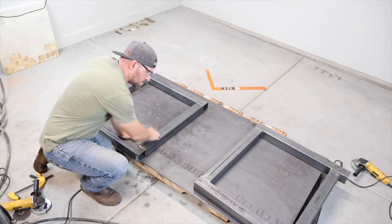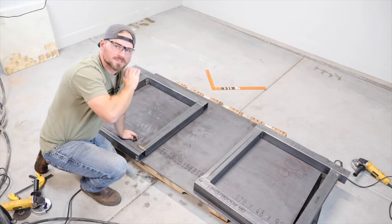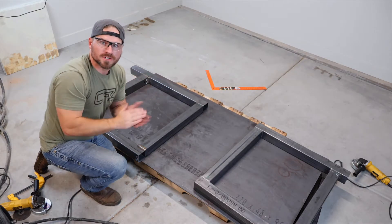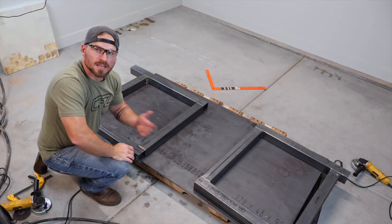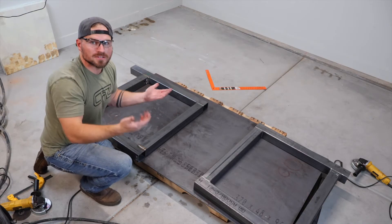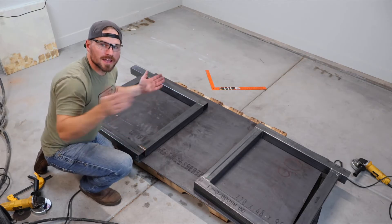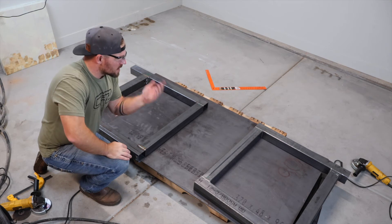I have both sides completely welded. Now I need to grind off some of the welds so the cross members can butt up nicely to them without hitting an awkward surface. One recommendation: always grind off your ugly welds and keep your nice welds to the outside. I went ahead and looked over all of them, did some wire wheeling on a few, figured out which ones were the nicest so they'll be on the outside — that way if somebody walks in, they only see the nice stuff. Let's go ahead and get to grinding.